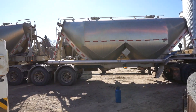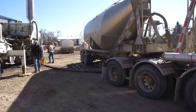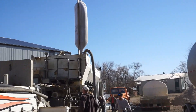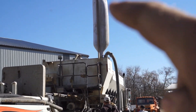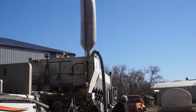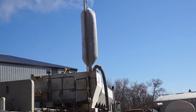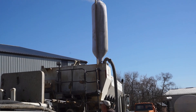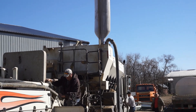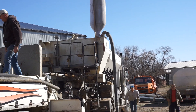You can see there — like I was saying, this is our cement bulker, which is hooked up directly to the truck there. On top of the truck what you see right there is a dust bag that just collects the dust so that as you're blowing the cement powder into the bin, the dust doesn't all escape. Most of it stays in that bag as you fill the bin. And then we just fill the bin continuously, or just start and stop as we need more powder.